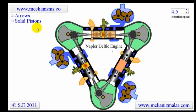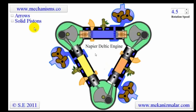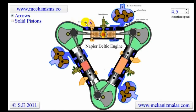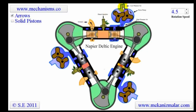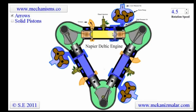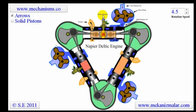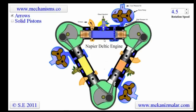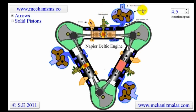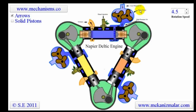And as you can see, to maximise this, and this was the whole point of the Deltic engine, was to make the most of this. A lot of these engines have two cranks, one at either end, and some pistons basically coming together. It's almost like a reverse boxer, if you want to think about it like that. Now, obviously, you can see it has some superchargers, because the ports are at the bottom, so there's an exhaust here, an intake there.